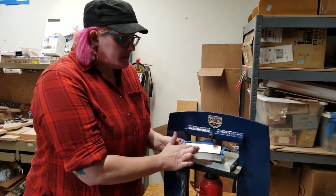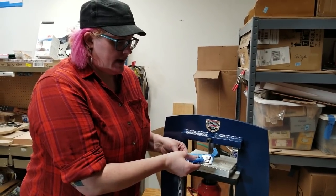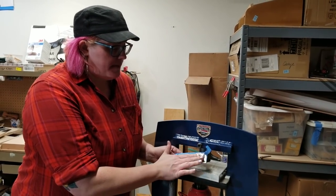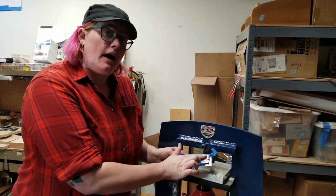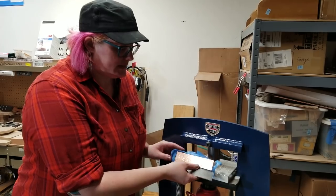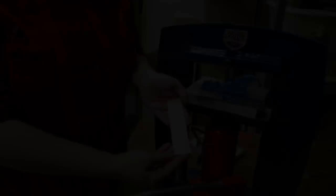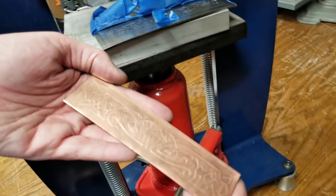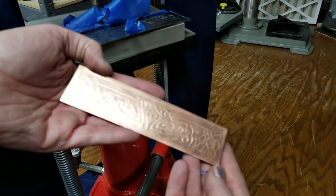It's possible to re-register your metal into the design, but it's not going to be very easy. So make sure you can see the impression or shadow of the pattern showing up all over before you undo it, because it's possible you won't get it lined up correctly. Overall, I'm pretty pleased with this — it'll really pop once I get a patina on it. Thanks for watching.